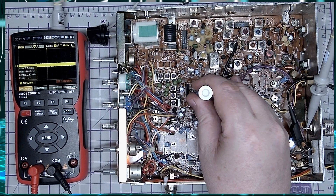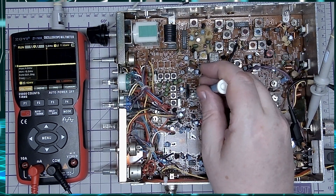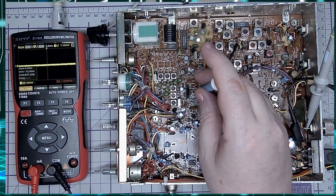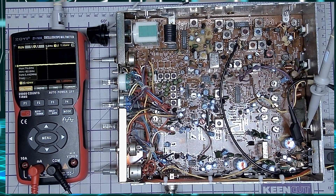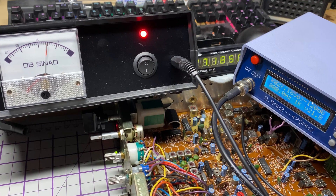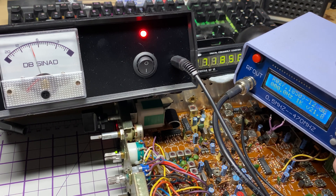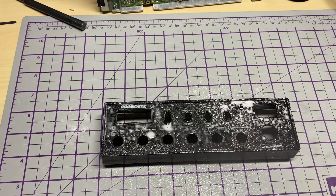Let's have a look at the carrier leakage. SSB, no mic input — checking upper and lower sideband for carrier balance, getting it down to as minimum as possible. Very nice. Now everybody's favourite part of the show: the SINAD readings, because every good technician and engineer must show their SINAD readings. So 27.185 MHz — around about minus 100. Yeah, it's good enough.